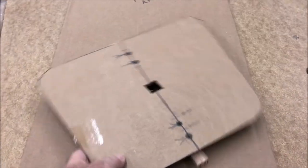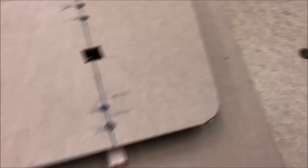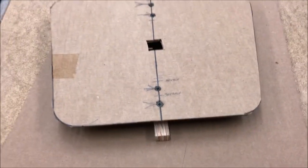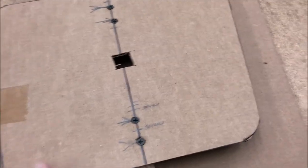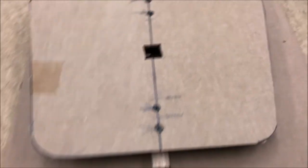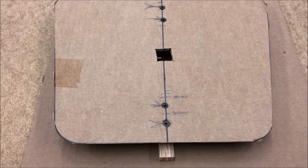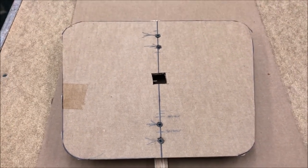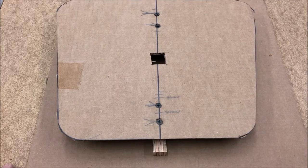I went out in the boat and tried this out. The overall shape was just fine, not a problem at all. The problem is the cleats — there's the bottom one and the top one. I realized I need two of these to keep the hatch cover from wobbling, and I really need the top one to be deeper because there just wasn't enough room to slip it up, have it clear, and drop back in. Overall shape could have been a little bigger, but it's just fine. We just need to adjust the cleats. Unfortunately it's too tight for photography inside the boat, so we'll fix it here and try it again.